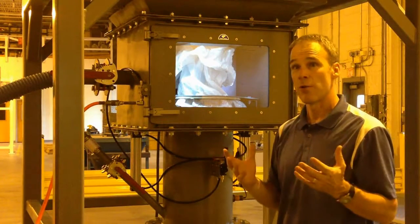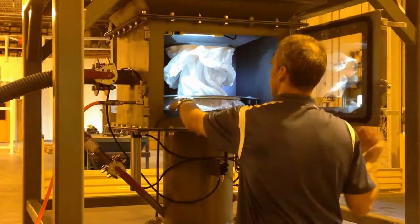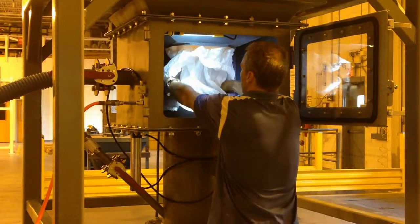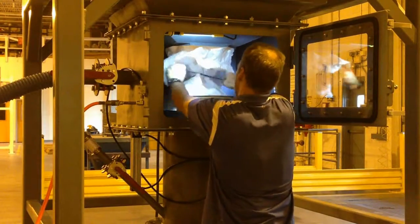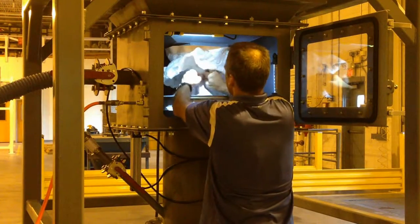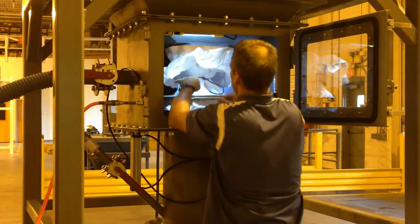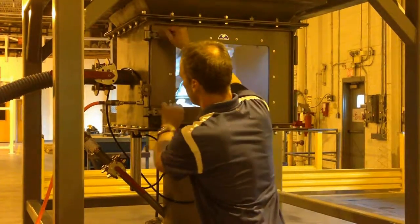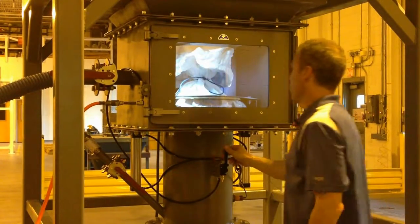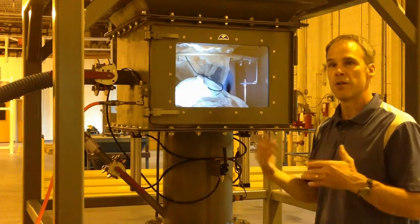The critical factor to keeping material off of your plant floor at the end comes down to operator usage. We always recommend, when we're done and before we raise the clamp, to come back in here with your tie and tie the bag off — so that if there is any material left in that bag, we don't have it falling on the floor. We raise the clamp and you're ready to change out the next bag.